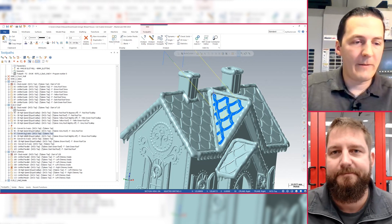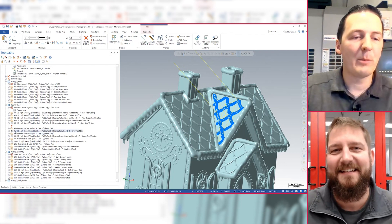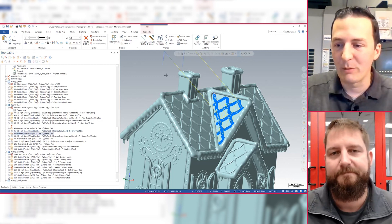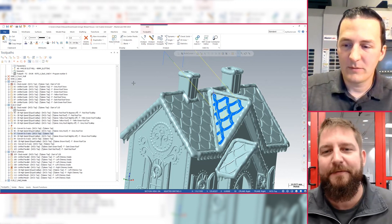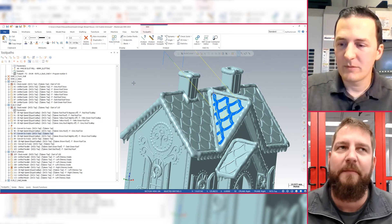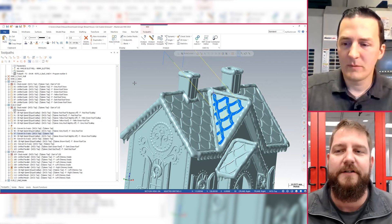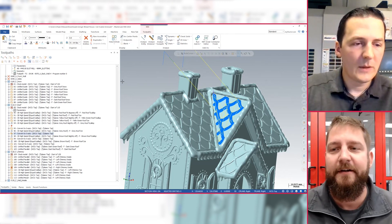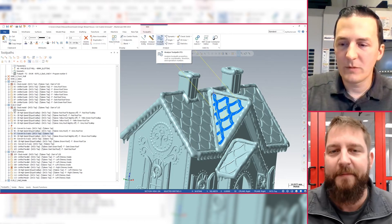That's great. Really, this convert to five-axis is underappreciated. It's a somewhat obscure toolpath to use, but if you think about it as keep it simple — make your three-axis motion first and then make it safe — it's a pretty effective way of programming a multi-axis machine. And there's been a lot of nice little learning steps for me. Some of this is stuff I've been well aware of, and some of this stuff you just don't put into practice enough. On a part like this, to see how much we actually use three-axis paths and did the convert to five-axis and are getting a surface finish I expect out of our program, our machine, and our tooling — it's been phenomenal. It's been resounding: let's go back to basics, let's keep it simple, and you get a phenomenal product out.